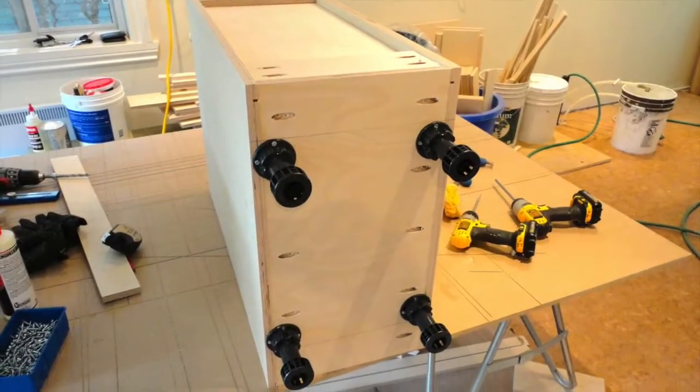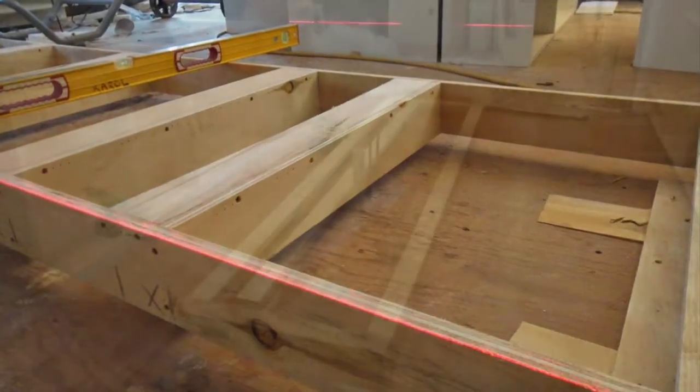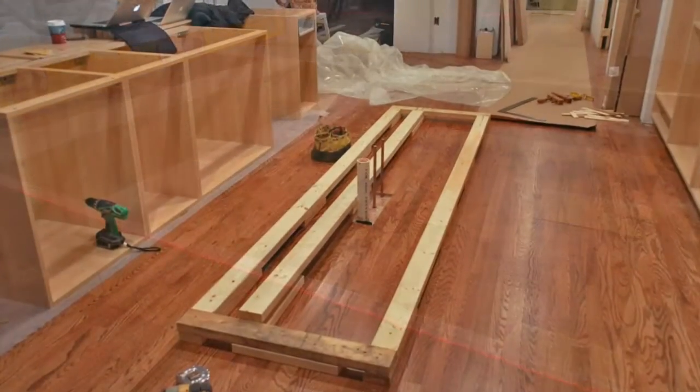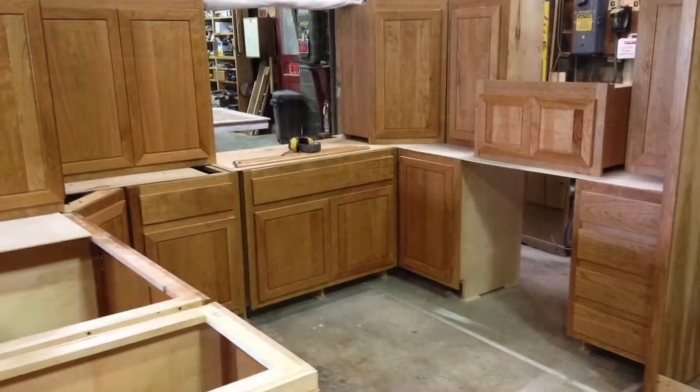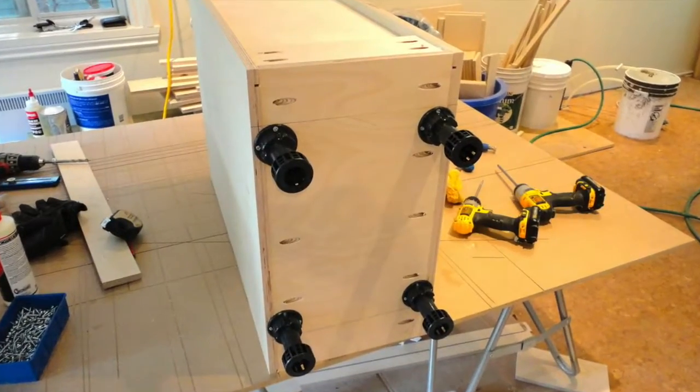Domestic or commercial, kitchen installation techniques by a professional installer or home handyman remain the same, consisting of either the attachment of individual adjustable feet or the pre-installation of a permanent ladder frame kickboard to support the often heavy and cumbersome kitchen cabinets. Each has their own advantages and disadvantages.